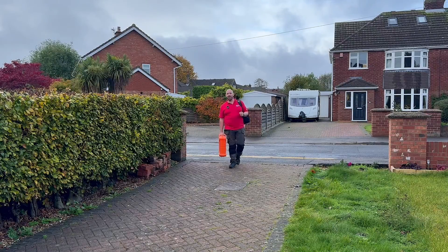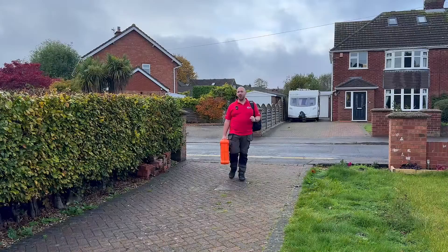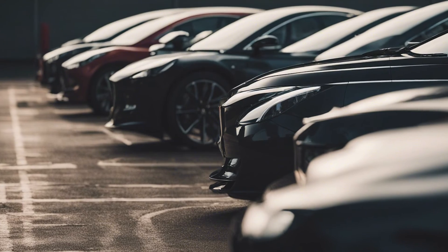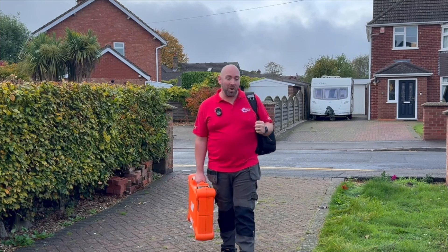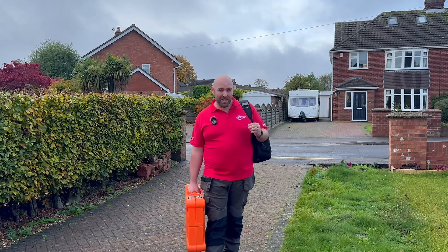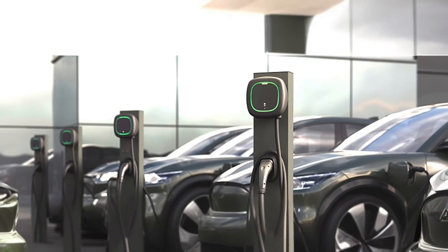We're at another EV installation today fitting the Pulsar Pro from Wallbox. You might recognise this unit from a previous video with Gary, but that was the Pulsar Max. The Pulsar Pro is designed for more commercial installations with built-in 4G connectivity and a two-year data plan, making remote management, auto updates and setup really easy. The customer is trialling this unit on their property as they have a big commercial project coming up and want to tap into the functionality and the power sharing option which can share up to a hundred Wallbox chargers. They're also going to be cashing in on their driveway when it's empty with community charging.